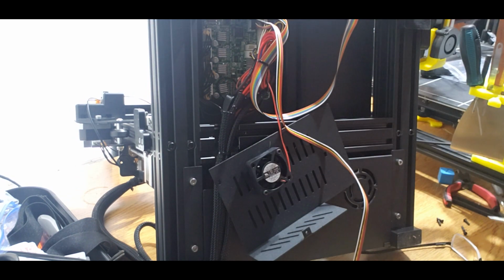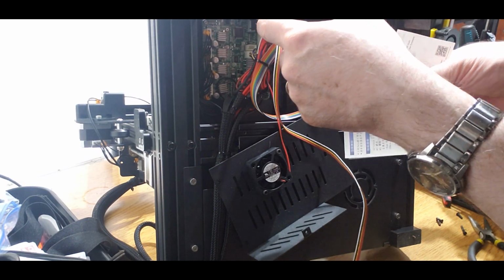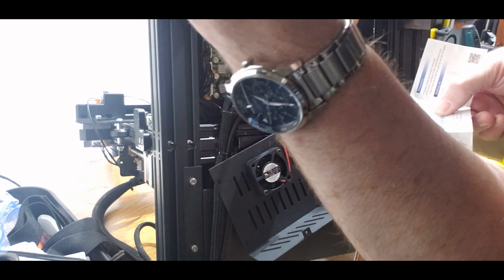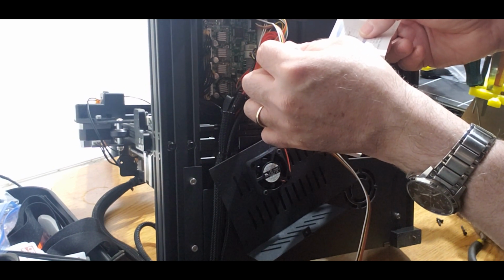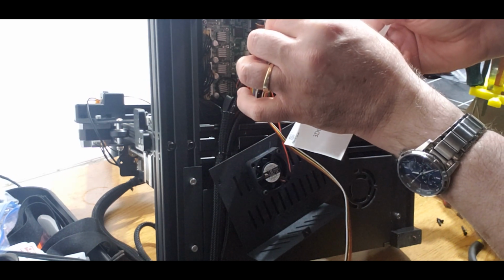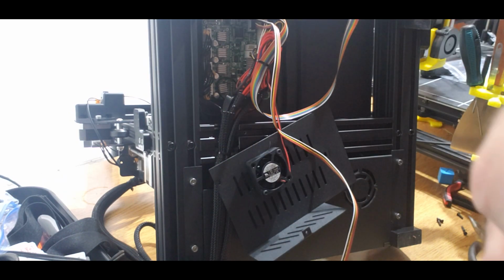All right. So if I'm following this right, the 3-pin is the brown, goes to the ground. So ground, volt is the red, orange is the control signal, mine's yellow, so that's the in, and then the ground is the black, and the white is the out. See if I can take a picture for you.